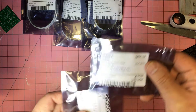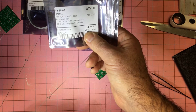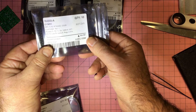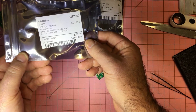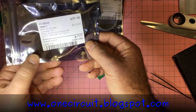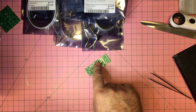What else is in the package? This looks like a regulator — it says fixed 5.5 volt input, 3.3 volt output, 300 milliamp SOT-23-5 regulator. And this is an MT3608 SOT-23-6, which also looks like a voltage regulator. I'll need to check the part number on that one, because some of this order is just for me and I'm not sure which is which without looking at the board more closely.